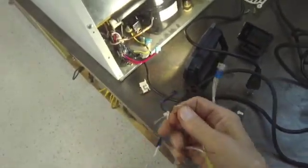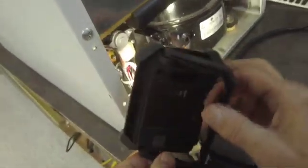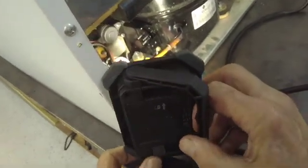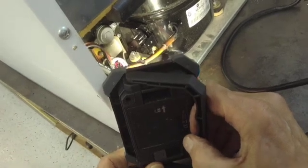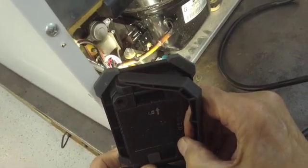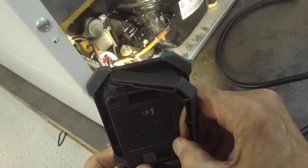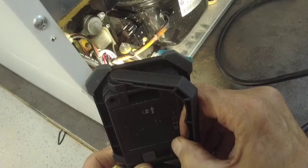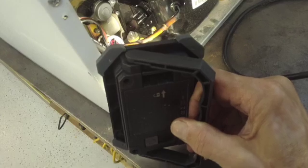You've got a black and a white wire. Now if you notice the terminals on that compressor, there are three pins — two on the top and one down on the bottom. The one on the bottom is the common, the one on the left is the run, and the one on the right is the start. However, you may find in some compressors where the pin is on the top.